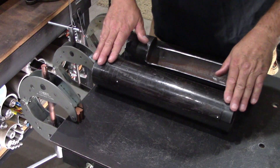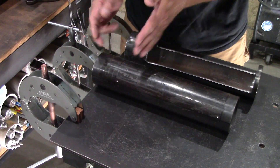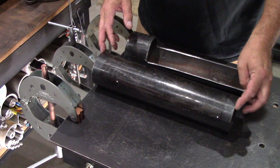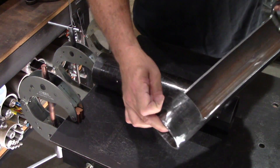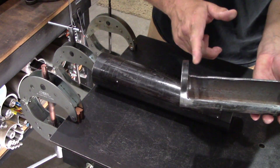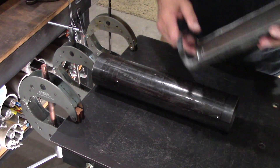We're going to take this tube which I measured out to be 15 and a quarter inches. I picked that length because when the cylinder is closed, your puck is going to be right here, and when it's fully open it's going to come close to — but not bottom out at — the very end of the tube. Essentially we're going to turn this tube into the crushing cylinder. I want to make the opening a little wider here, going from half-inch to one-inch.